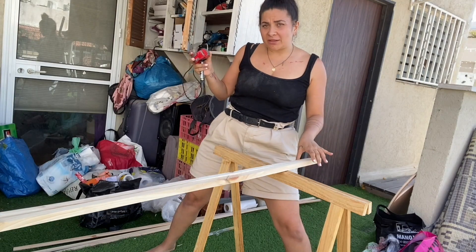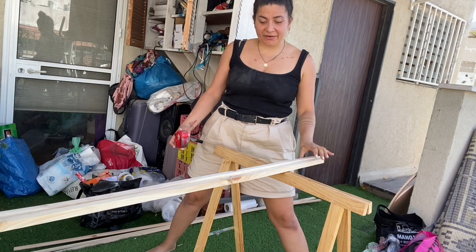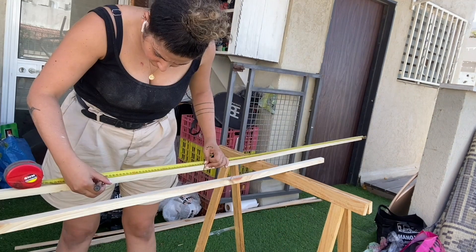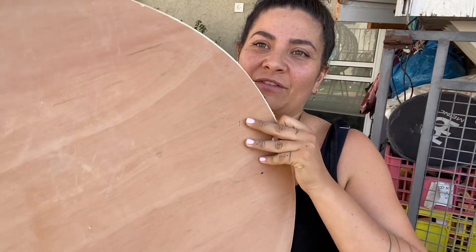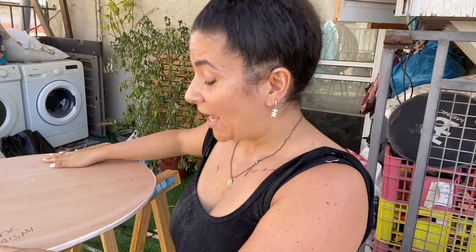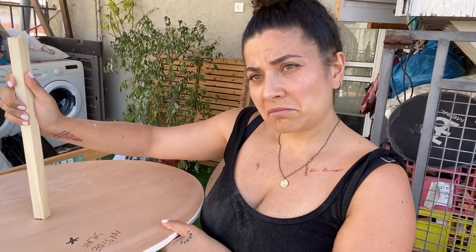Now that your t-shirt is completely covered in wood crumbs, it's time to layer up all our pieces and make this 3D. I got two very long sticks that are going to give us the height of our seating area — 35 centimeters. Make a mark every 35 centimeters. Consider that the height of a stool is usually about 40–45 cm, but we also have the depth of the wood itself, which is why we don't do the entire amount.